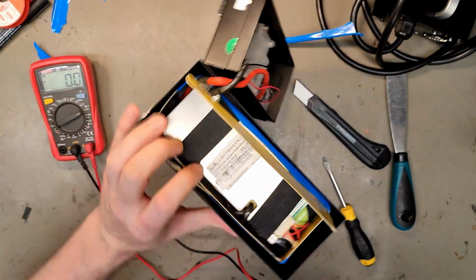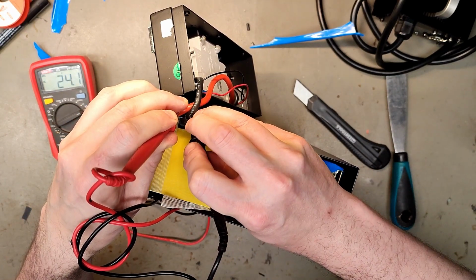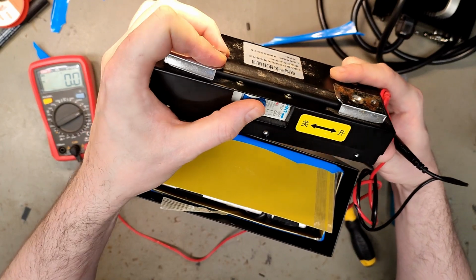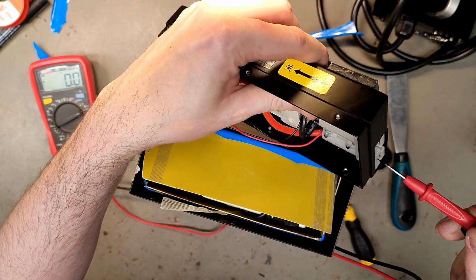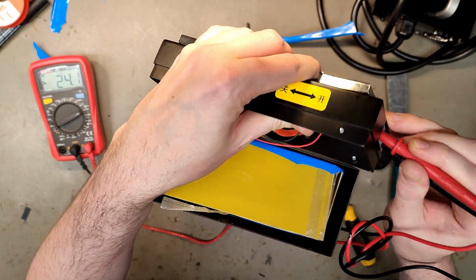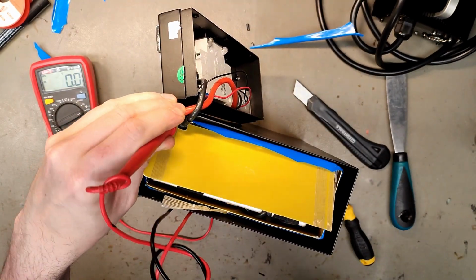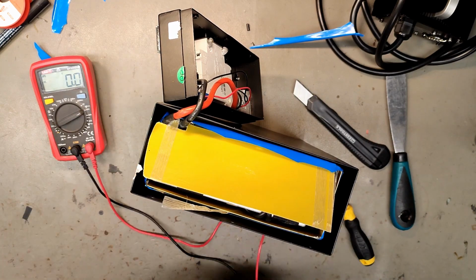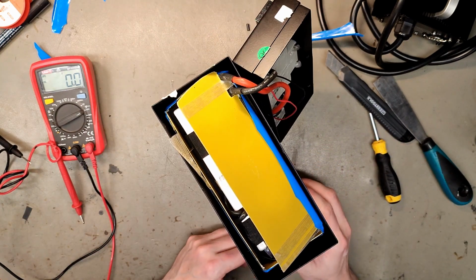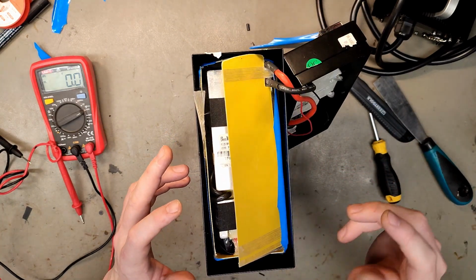Let's measure discharging wire. Same hole. Here we're at 24.1. So why are we getting zero voltage? Red usually means on in this situation. 24.1, but actual incoming voltage is 24.4, meaning the BMS is turned off, and we can see that since the voltage difference. If the BMS is on, the voltage here is the same. So now I'm guessing a dead or low cell group.